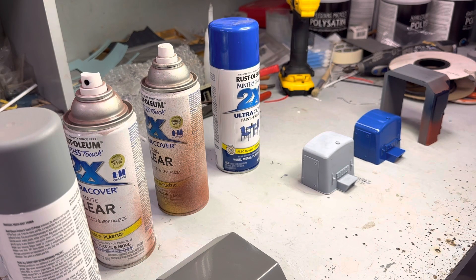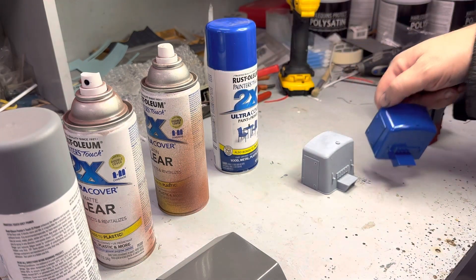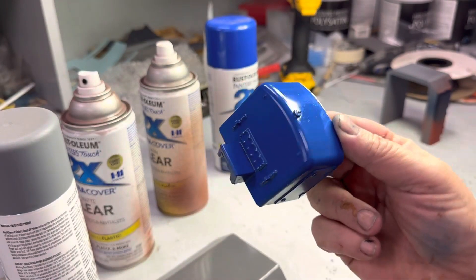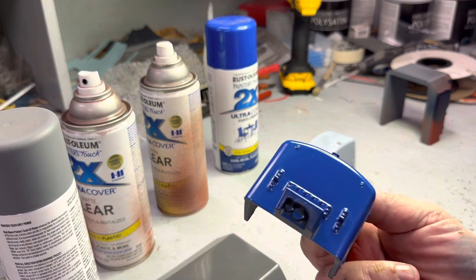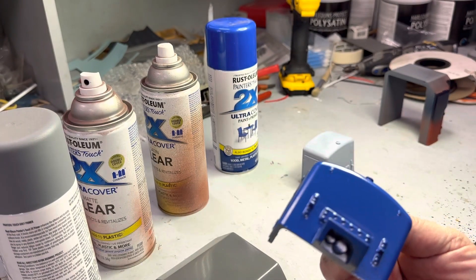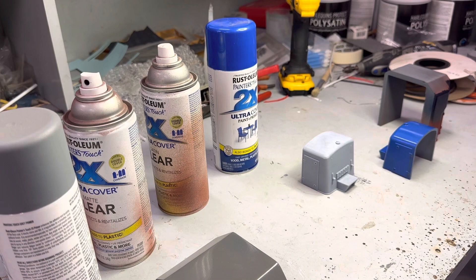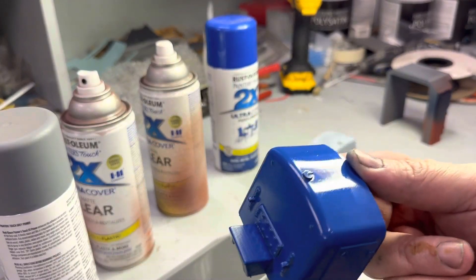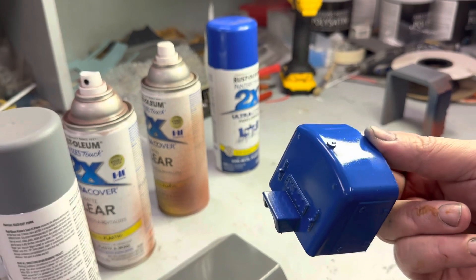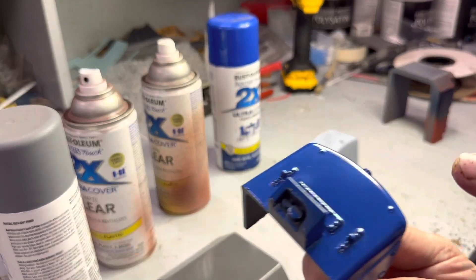Take a piece of paper and write this down. If you decide to continue with Rustoleum as a cover coat, then take the gloss or whatever you're going to put on there, spray it on in one go - lightly, in layers - until you've covered it. Be careful because it's now very, very smooth - it will run. Cover it nicely and let it dry. And then from there on you are stuck, because after this whole thing's done and you've got your gloss coat on here, you cannot put any Rustoleum clear coat on it ever again, because what will happen is it will fish-eye - little fish eyes like that.